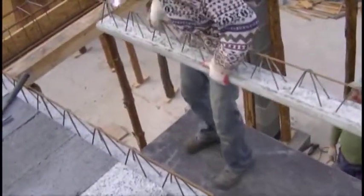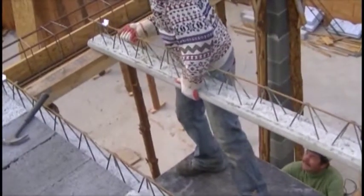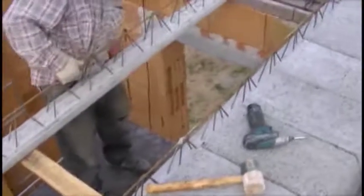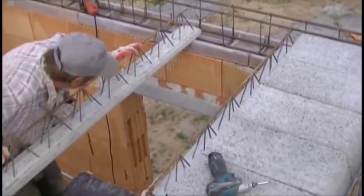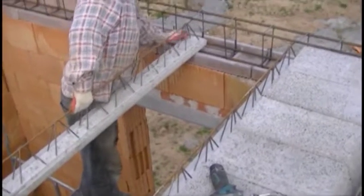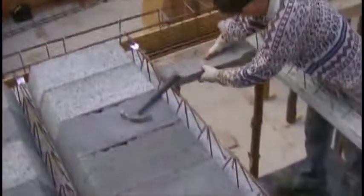And this is how we put the beam between the rear and one of the substrings. Note that the upper edge of the shuttering board of the substring is placed at the same level as the rear formwork. The beam is slightly inserted into the reinforcement of the substring and rear.